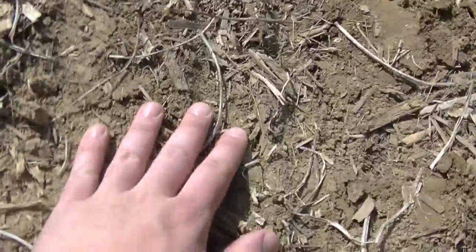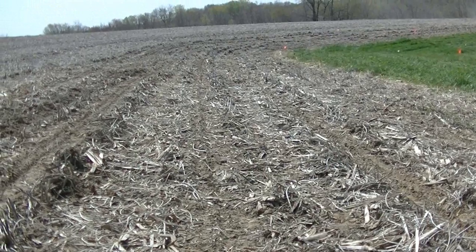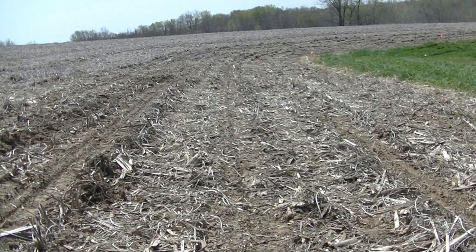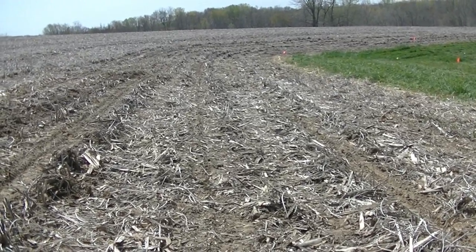And you can see, now the furrow is right here, and when those spikes came through, they pushed all the trash and debris off to the side on each side. So it cleans it out and pushes it to the side so that it can put the seed in the ground, and then it gives the plant a pathway to come back up through when it starts growing.